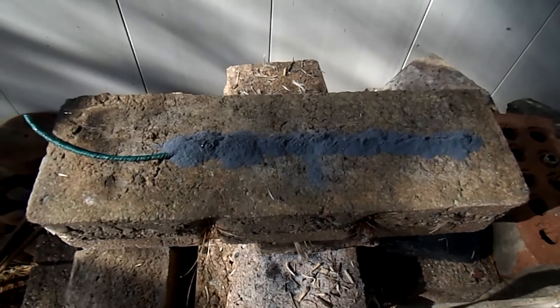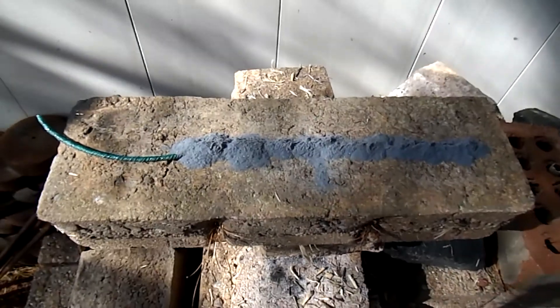After the comp is all mixed up, you're ready to add 6% water and then you would granulate it through a 20 mesh screen and it's ready for pressing. I have about a 10 inch pile of the loose composition.